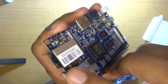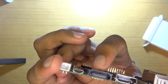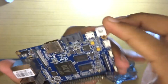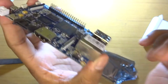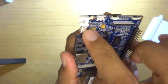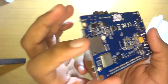We have two USB 2.0 ports, and here we have our SATA connector — compatible with 1.5 gigabit and 3 gigabit SATA connections. This right here is the 5-volt power connector for SATA drives. We also have boot and power switches, an IR sensor, an audio jack, a debug port, and two micro USBs — one for OTG and one for power. There's also WiFi and possibly Bluetooth, plus a micro SD card slot — no eMMC.